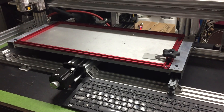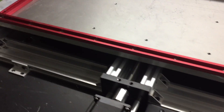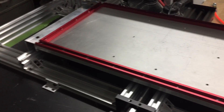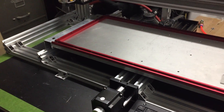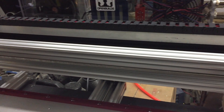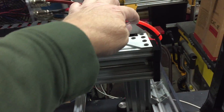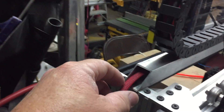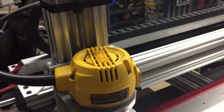Some of my other videos will show enhancements I made, like to the gantry plate for the router and some of the changes I made on this big plate here. I've explained how these things work, shown examples of how the wheels work, and demonstrated durability by putting 25 pounds of lead on one end with a dial indicator on the other. I added a one-inch square tubing bar across here, which gives me a place to run cable guides and a hollow chase for bringing wires out — like the X-axis from the other end — and plenty of room to run my limit switches, which I'm converting from micro switches to proximity sensors.